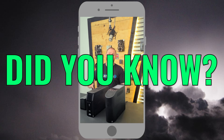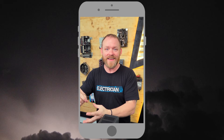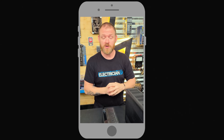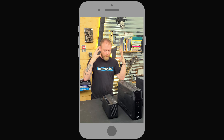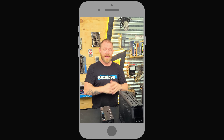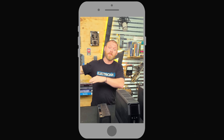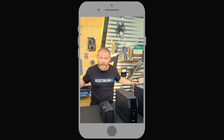Did you know that surge protection has nothing to do with lightning protection? A lot of people think 'surge protector — oh, it's going to protect against lightning' because on the marketing packages they put a little lightning bolt, but it has nothing to do with lightning. All a surge is is when a piece of equipment turns on — say like an air conditioner — it sends so much current at first that it surges the entire electrical system. Surge protectors just cut the peaks and valleys off a spike every time it surges. We also put whole-house surge protection on homes to protect against line surges from the utility company, and you can add small surge protectors on pieces of equipment as an added layer of protection, but it has nothing to do with lightning. Now you know.